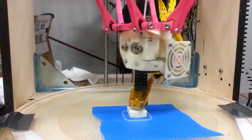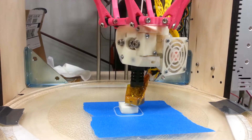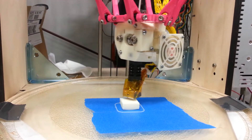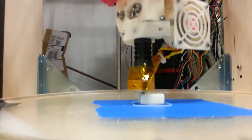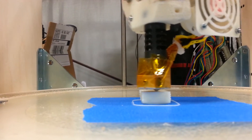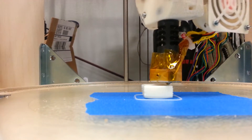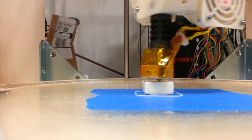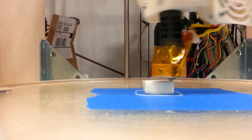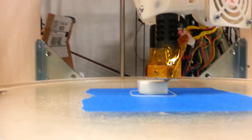I think I like the way it looks. I'm not getting any unusual pendulum effects — it's actually printing pretty accurately. There are blobs at the corners; I don't have the retraction calibrated. I think I'm printing a little bit sparse, I need to turn the print height up a little bit, but hey, not bad.